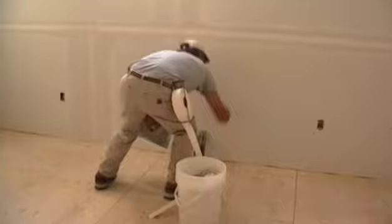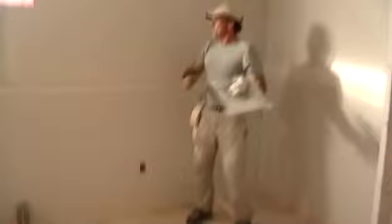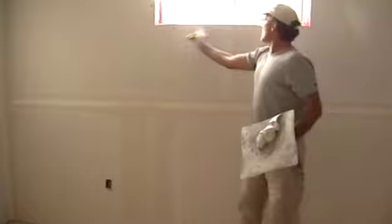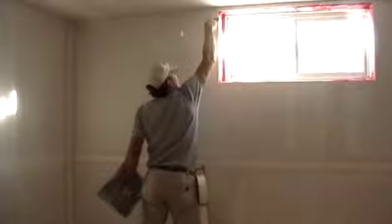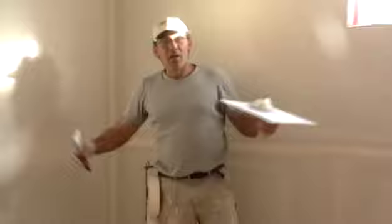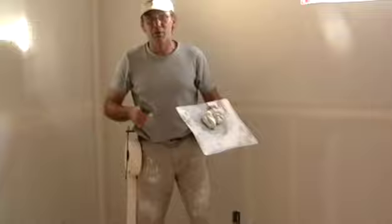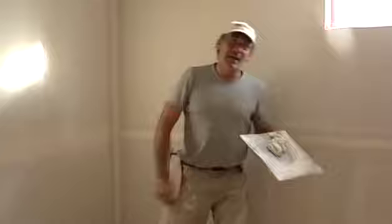I'll just make my way around and get these screws coated up. If you are a professional, you must move at this speed or faster to be able to do this job. Once they're all coated up, we will have the first coat done on this wall. I've got other work to do in this basement and this whole room to get coated up today. That's the first coat of the screws. Even if it's near where the trim is, give these one shot so that you make no risk of the trim not reaching it - it makes for less touch-ups later on. Corner beads and other parts of this first coat you can find in my other videos. Next, I think we're going to go second coat some butt joints and a taper joint.